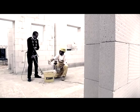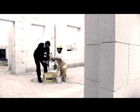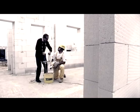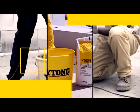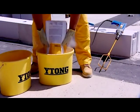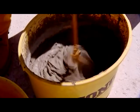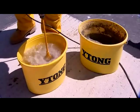It took me a while to learn the ropes, but the master bricklayer was patient with me, explaining everything. Etong thin layer mortar is used for bricklaying — I understood why the mortar is called glue, as it has similar properties. Preparation of the mortar is very easy: all you need to do is mix it with an ordinary electric drill, so you don't need a mixer at the building site. The mortar is applied in thin layers, so much less of it is used compared to classic technology.